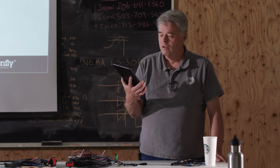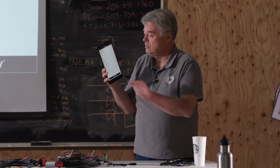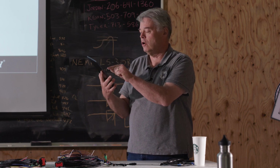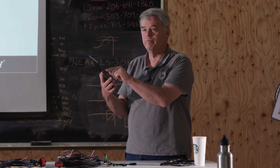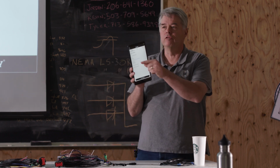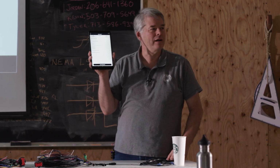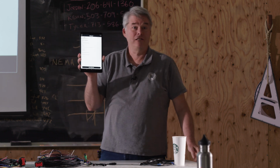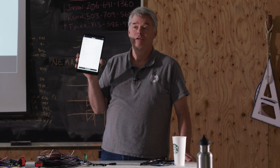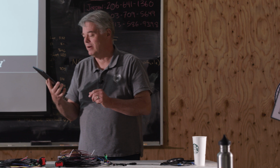Okay? The next thing that you will want to probably edit, and you'll notice this has got a little note here when you pick that alternator. It says you have to use a certain part number to convert that alternator for external regulation. So a lot of the stuff, a little note will pop up to give you hints. You can talk to Rick. He's got the magic decoder. This is actually really exciting. This is a modern alternator with a factory conversion kit, if you can get that part number. So talk to Rick to figure out how to do it, because I'm personally really excited about that.